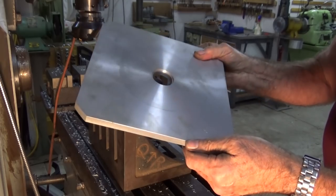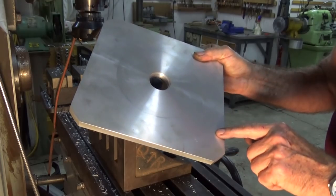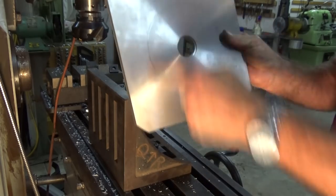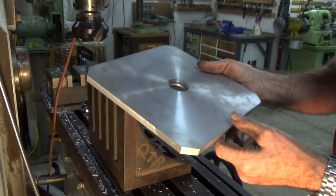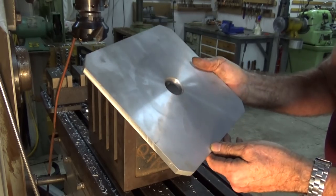So what I need to do tomorrow is to cut the slot in the top of the table here for the mitre fence. There's some local thickening on the back of the casting and the slot will actually be on this side. And we need to cut the clearance in for the blade, so we can assemble a blade onto the saw and drill a few mounting holes, and we're nearly done with that. So yeah, it's looking good.